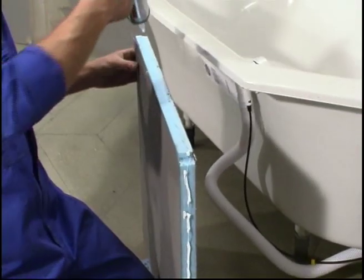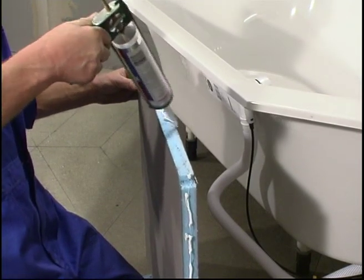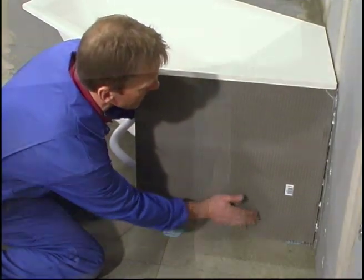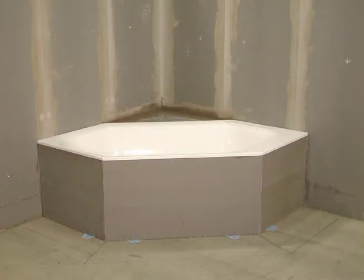Putting silicone on top of the panels is the easiest way to apply it to the joint with the underside of the bath. Once the step is in place and it's all taped up, this will be going nowhere. I try to put silicone on the fixed surfaces where I can, as this means easier handling of the board during construction because I don't end up with silicone all over my hands. The panelling is complete already.